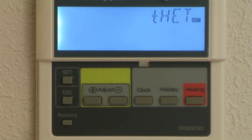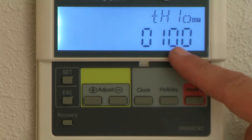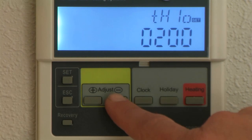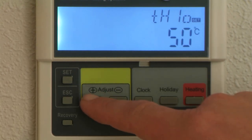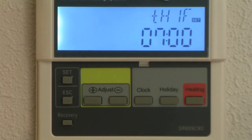The next function along the menu is called timing heating. Press the set button to get into that menu. This is timing heating one on — there are three time zones where you can switch your element on. We've got the first time zone to switch the element on at 1 o'clock in the morning. Press the set button to go in, and we can see that the 1 o'clock is flashing — press plus and minus to alter it. The set button again does the minutes. The third setting in timing heating one is the temperature you want the element to come on — if T3 is below 50 degrees it will turn the element on. This is still overridden by your thermostat in your hot water cylinder.